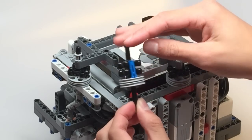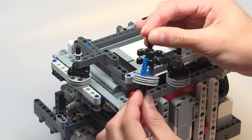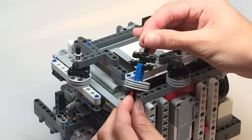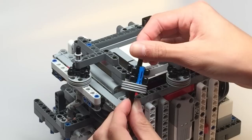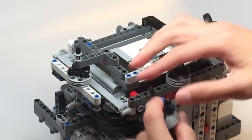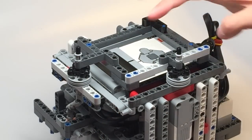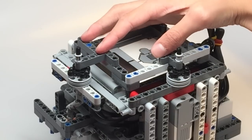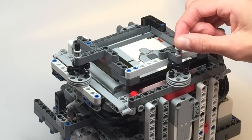And instead of using just one clutch gear, we're using two. So now if it were to break and jump, it'd have to go too high, and that's really unlikely for an attachment to jump that high. Or what you can do is have big attachments. If you have a big enough attachment, it'll push down since it's really heavy, and it'll be able to minimize the effect when it's jumping.